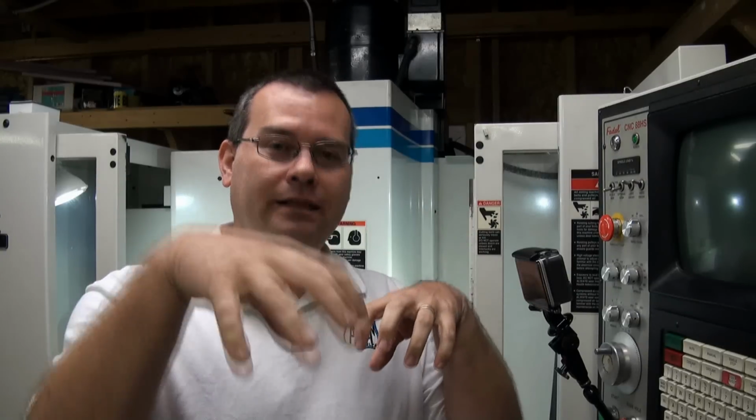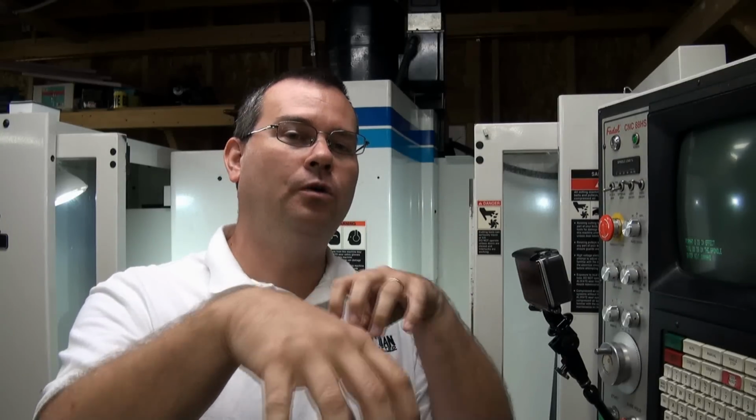So these machines use software flow control. It's called XON, XOFF type of flow control. So there's two characters, called XON and XOFF, how novel, that are sent between the PC and the machine to control the flow of data.